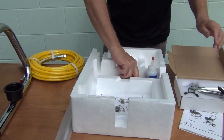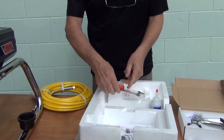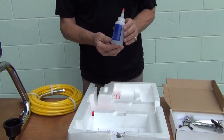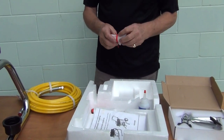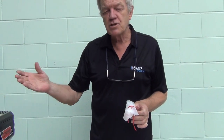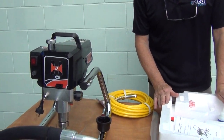Also in the box, you're going to get a screwdriver for repairs and a 19 mil and 17 mil spanner. You're going to get a bottle of lubricating fluid, which I'll explain shortly, and obviously an instruction booklet. This item here is not a hairnet — it's actually used to filter the paint, because it's most important when using this type of equipment that you have really clean and lump-free paint. We'll stop the camera for a minute, set up the unit, and see it in operation.